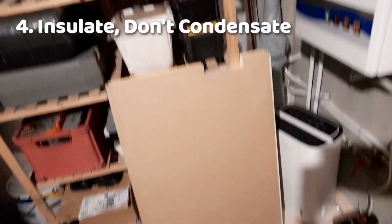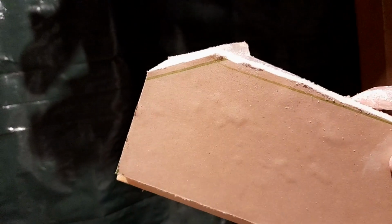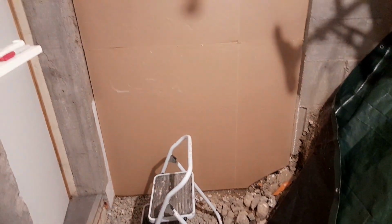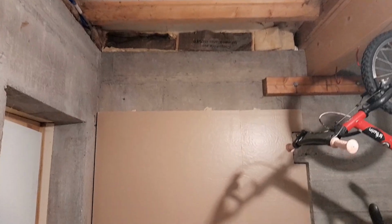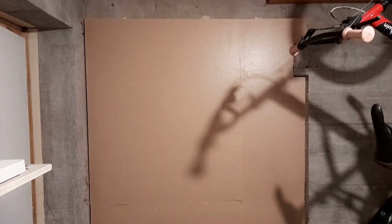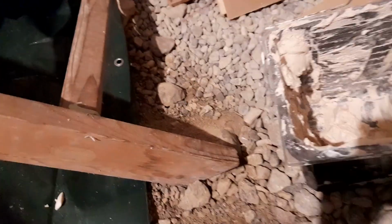So I've got this kind of, it's not styrofoam, but it's similar panel insulation, about 4 centimeters thick. Over here goes by the brand name of TMS. Cut it down and started putting it in over here. Tongue and groove system, and I'm using an adhesive mortar. And this wall's going to be insulated. And this is the mortar.